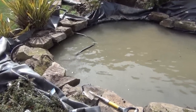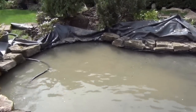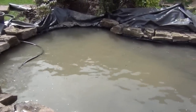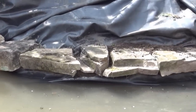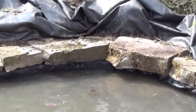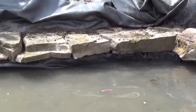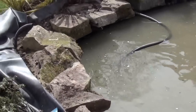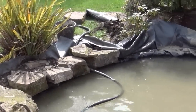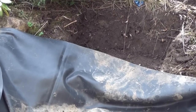Right, this is the second day. I've been joined by somebody else helping, which is very good because these stones are mighty heavy. The pond was filled up last night and we've started putting the stones around the sides, more or less level — we're cementing them in and then back-filling with soil. Obviously the pond isn't up as high as it'll go; it should come up pretty much to the top of those stones, but we don't want the water affecting the cement. We're almost all the way around now. There's actually going to be a small cascade here, which will be pretty much just a tunnel pouring out over a spillstone back into the pond.